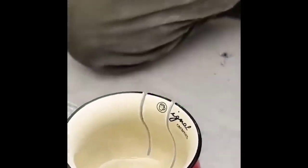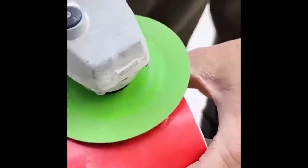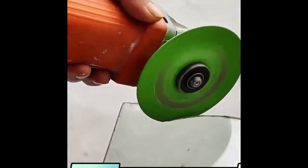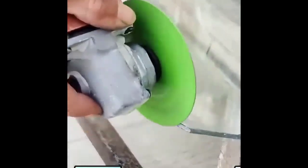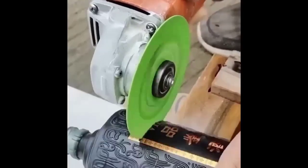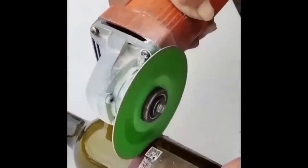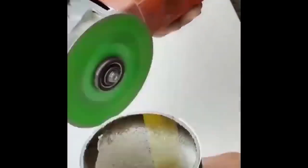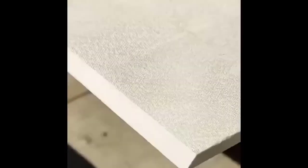The solid cutting disc is used for cutting ceramic and porcelain tiles, as well as marble, stone, and glass. It is used as a tool for grinders and tile cutters, and is designed for long service. The solid part ensures a clean and even cut without any chips. The disc width of 6 millimeters allows the disc to be used successfully in everyday life. The perforation provides better cooling of the disc and stability of the cut. The base of the disc is made of steel, so it holds cuts of hard materials without the risk of deformation.